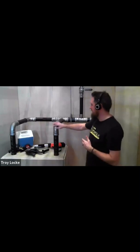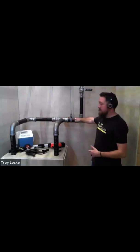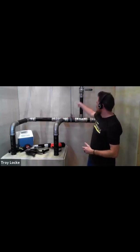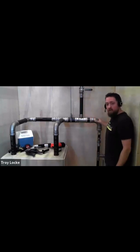As you can see here, I have two and a half inch 90s going into a three inch steam header, and then my main going up. You don't want a bullhead T because that could create some wet steam. So that's why when I come off and go into my equalizer, I actually have a three inch by inch and a half reducer.